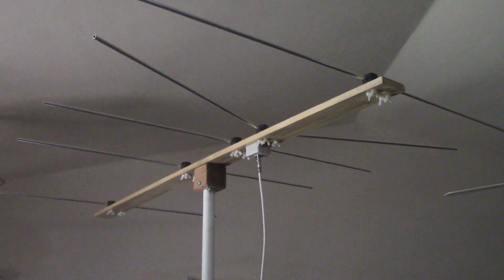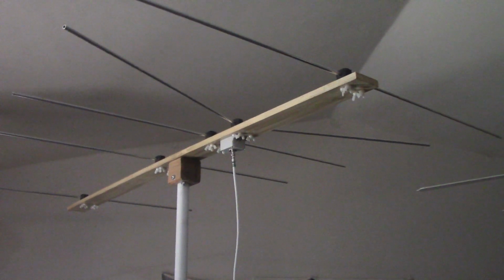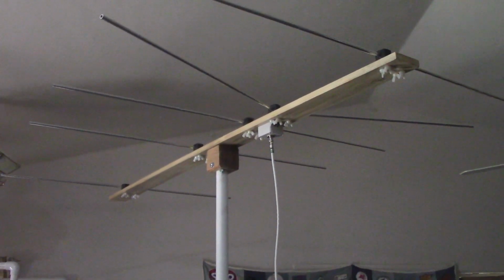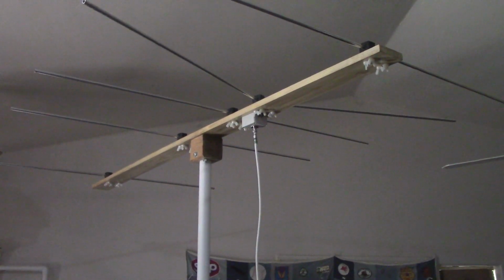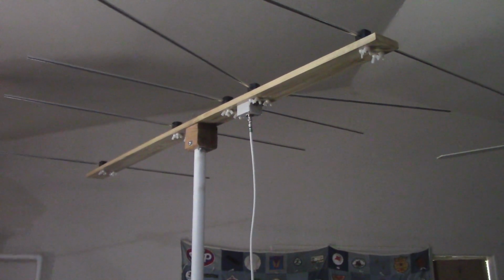It's hard for me to have any kind of permanent antennas up, especially if I also want to have antennas for ham radio. So I can just use my old Armstrong rotor and rotate this as I'm monitoring. And it also means that I can use a much shorter feed line. So in this case, it's only an 8-foot feed line.